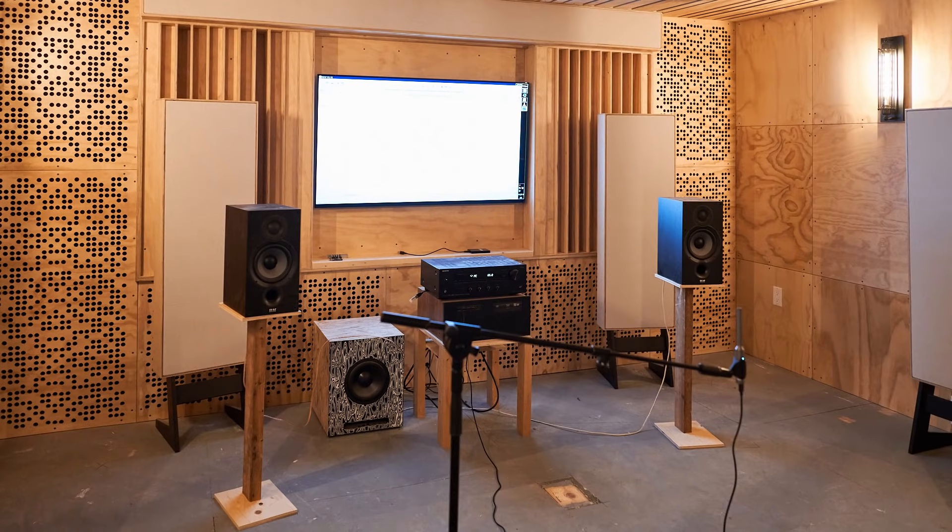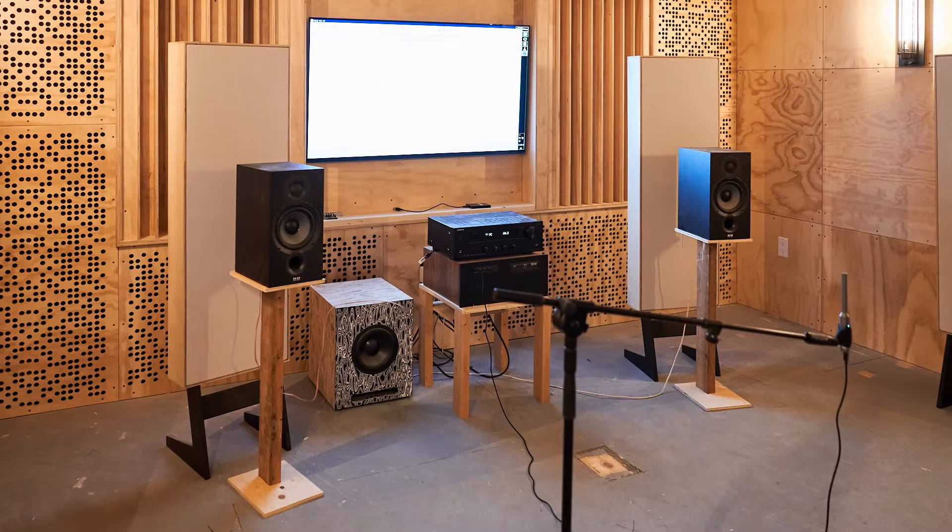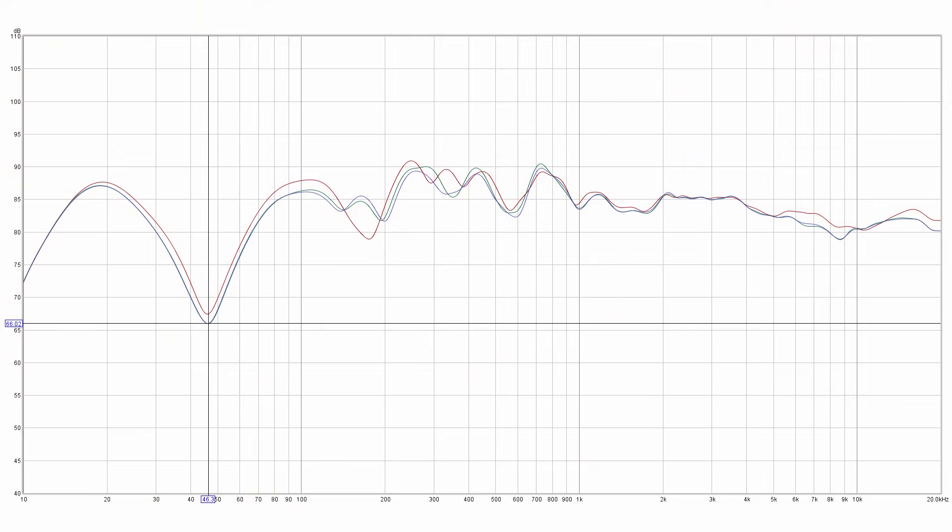However, I didn't want to go that route, so I explored other options. The first thing I did was take two of my new acoustic panels and put them directly behind the speakers up against the wall and ran another sweep. That didn't do a whole lot — it actually made the null deeper at the lower frequency, but it did fill in a little ripple at 166 Hz. I also tried moving the panels directly behind the speakers and ran another measurement, but the results weren't any different.